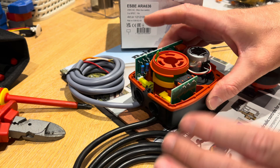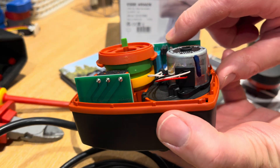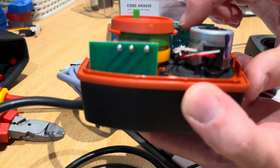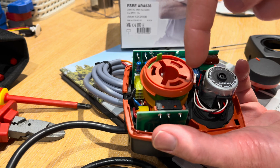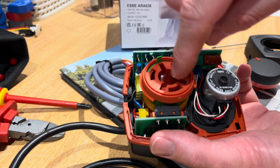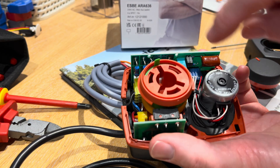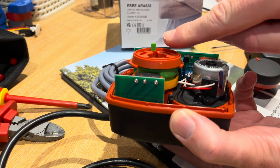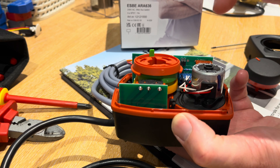If you want to change that, what you've probably never noticed are the two jumpers in this position here. I'll zoom in on the video and just show you those now. Those two little jumpers — if you notice, they are in the vertical position. What you need to do, if you want it so that when you've just got the brown attached as your permanent live, it's in the counter-clockwise position and then motors clockwise instead of anti-clockwise, you just need to switch these jumpers around so they're horizontal. So they're vertical as standard; if you switch those around so they run horizontally across the terminals, this will then power the other way. And that's how you still use the black wire as your switch live, but you power the motor the other way.